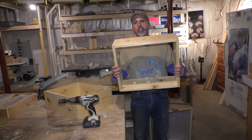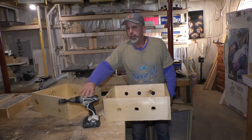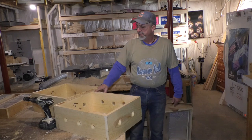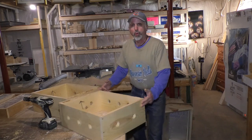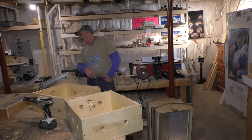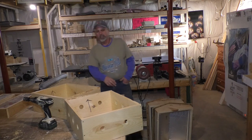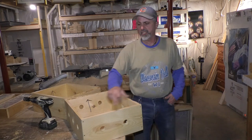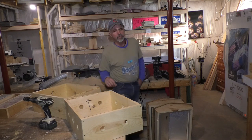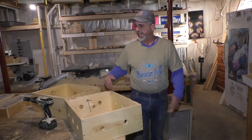These are just so simple. All you do is measure out your boards — take a deep or a super and match the measurements. I nail the boards to the outside rather than the inside. The outside board is 16 and a quarter inches, and this one here is 18 and three-eighths inches. Take yourself a deep and measure it that way — it's really easy. Just glue them together, nail them, and you're ready to go.